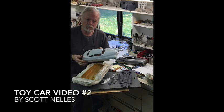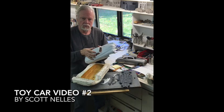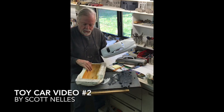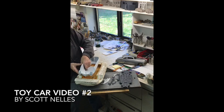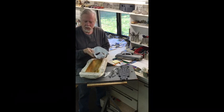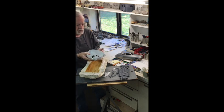So now I have here the plastic resin, polyester resin model of the clay '49 Merc, made out of the sealed up plaster multi-piece mold. Now the model no longer fits perfectly in the mold because I've made slight modifications, alterations, so that the metal won't shrink badly when we cast it.